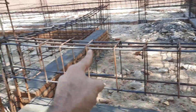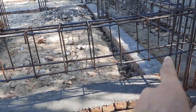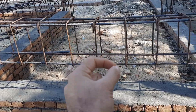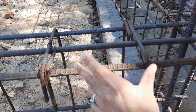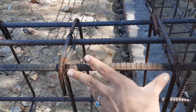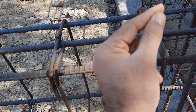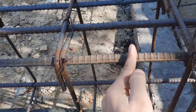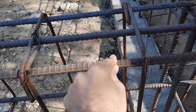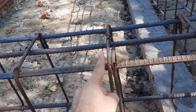The span is 10 feet; at the distance of three feet from each end (L/4), the stirrup spacing should be close together. After that, at the middle section, you can increase the spacing of stirrups. Unfortunately they did everything wrong. This appears to be done without a site supervisor — they don't know about steel structure design, they don't know about structural loads.